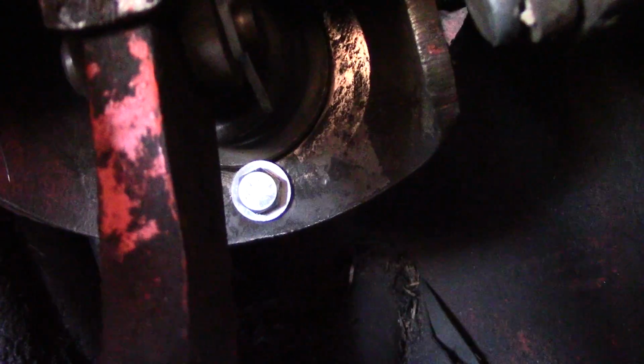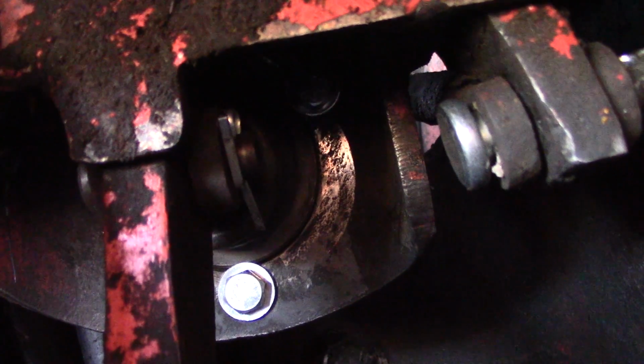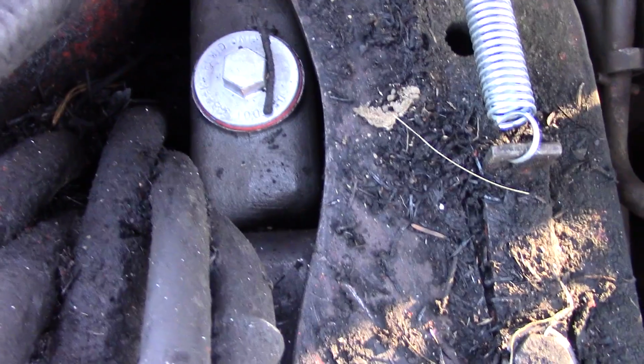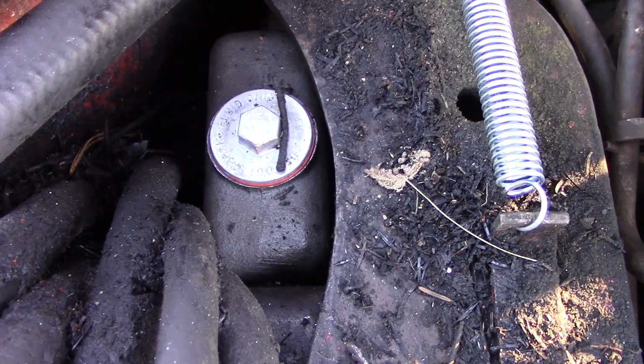And then the only thing I did was, the other one's held on there with 3/8 screw bolts. I just went to 5/16, and the bolt pattern worked fine. I didn't have to do anything else. And I made a new brake line, and away we go. Saved a bunch of money, and I can get it now in the future. This is the same one that's on my newer Timberjack 225. So now they're the same, and I can keep a spare one here, and everything's the same.